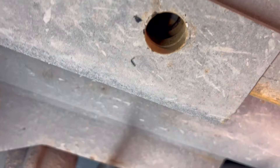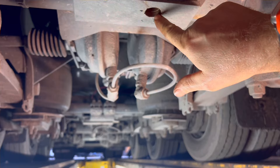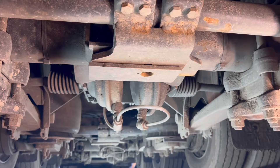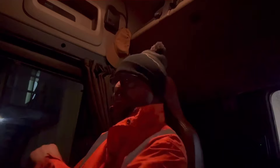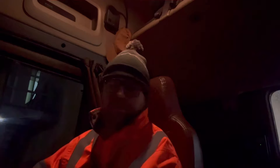This locking pin is the thing that's stopping it from locking - it's out at the moment. So when you put it in reverse, a pin comes down through there with all this, locks the steering and that means you can reverse slurry. So that's good, no real problems, hopefully we've fixed the locking device on the axles and we'll see when we get around the other yard.